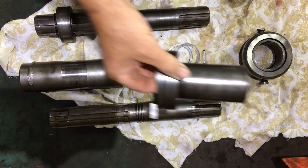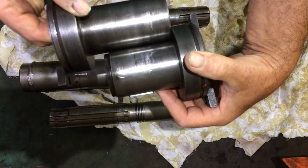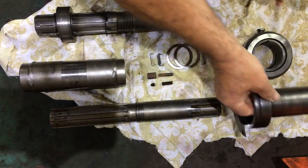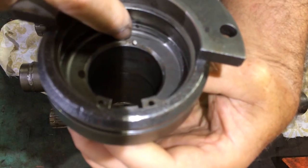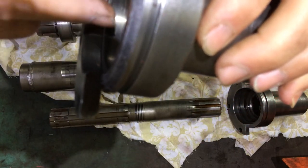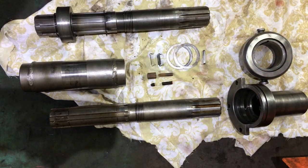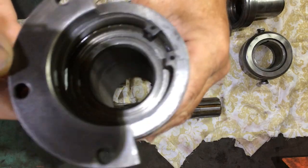So we have here the two support snouts. You can quite clearly see there is quite a bit of difference in the length of those support snouts. Also in this support snout, down on the bottom here, there is a drain hole which comes out here. So if this bearing fills up with oil that could be travelling along the shaft, it drains out the front end here but it drains into the clutch housing part of the gear casting — it doesn't drain backwards. My original doesn't have any drains in it whatsoever.